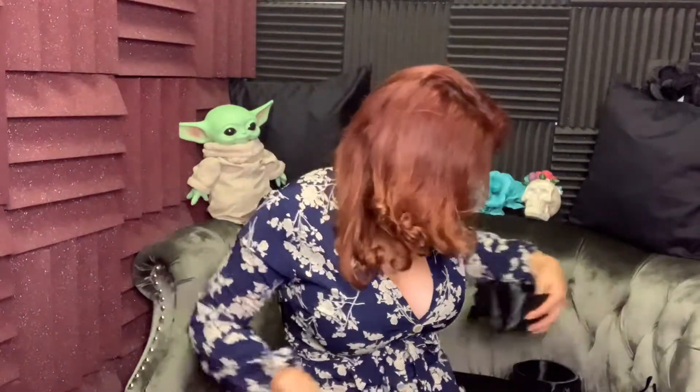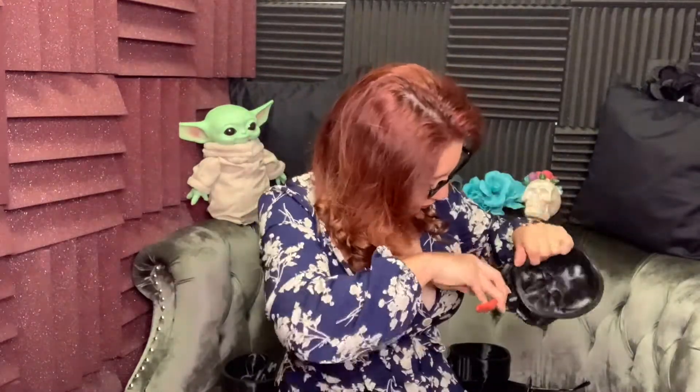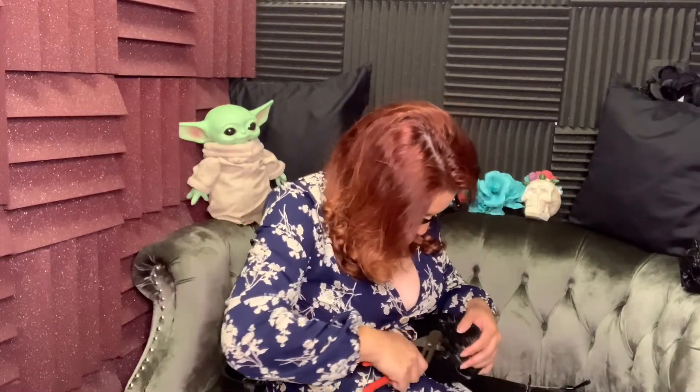Let's see what the non-support version looked like — it's actually cuter in the eye. So I'm going to try to rip this other one out and see if it comes out as easily. Not quite, but I am using Dykes instead of pliers, so it didn't come out quite as nice in the eye socket either. I already broke part of this one trying to get the supports off, just because I couldn't tell where they were. If you're going to print this file with supports, do it upside down, because right side up was just way too much hassle. Also, remember to wear glasses because these supports are kind of flying about everywhere.